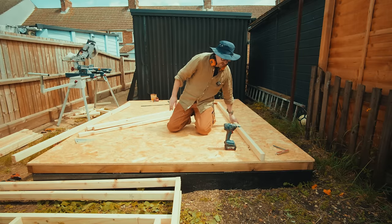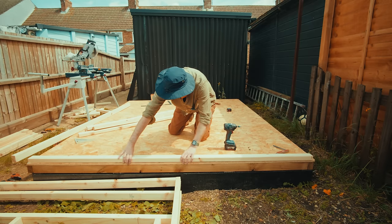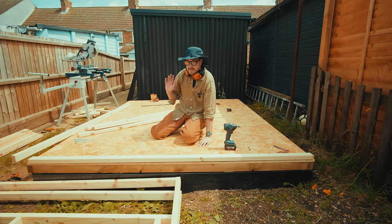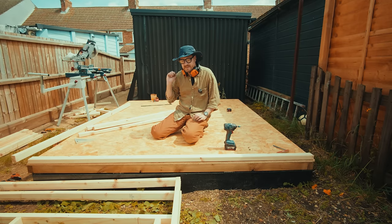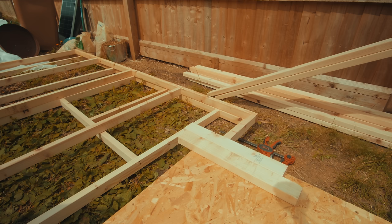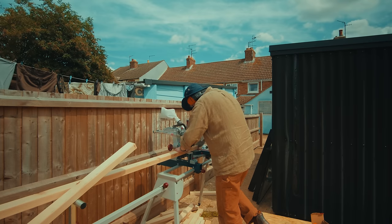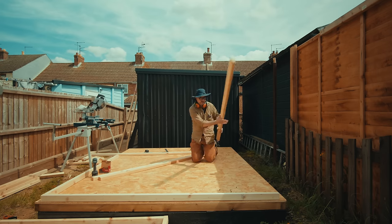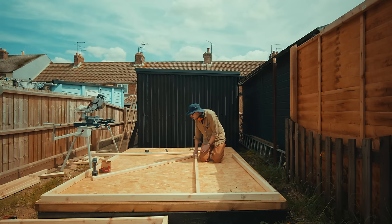I have all the uprights cut. I've been using pieces to represent the top and bottom, but that's not where the top and bottom goes — the bottom will actually go on here. So this looks like exactly the right length at the moment, but that doesn't take into consideration the thickness of the walls on either side. So I need to minus that off and get the pieces cut for the top and the bottom. That'll be the same for the front and back, so I can get four bits cut. Then get them all laid out and get some screws in to lock it all together.